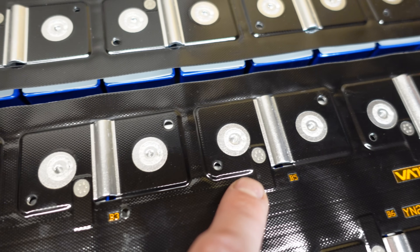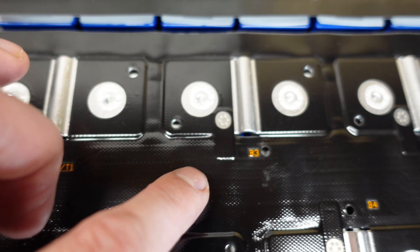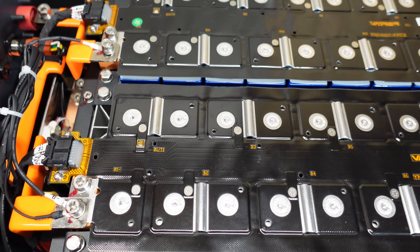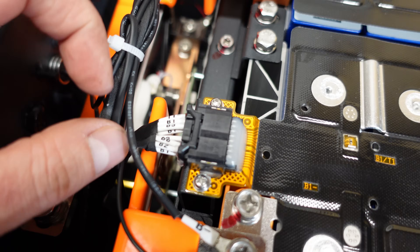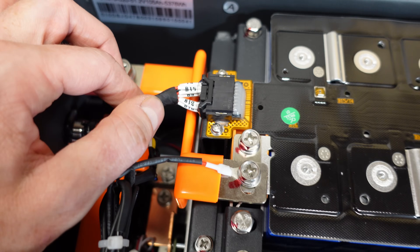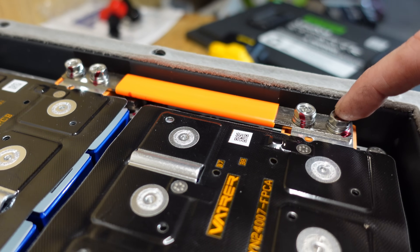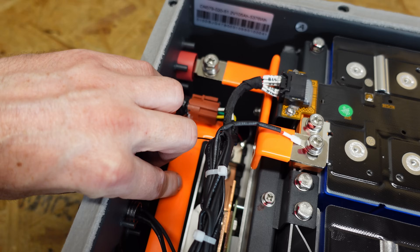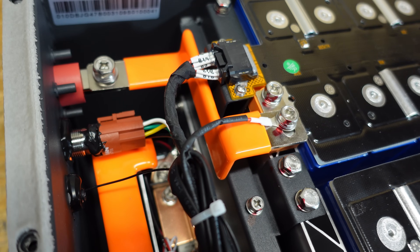They've laid a flexible mat across the top of the battery pack, and we can see each location where a balance lead has been spot welded to the bus bar. There are temperature sensors — B1/T1 and temperature sensor four — implying there are likely two more somewhere inside the battery. The mesh connects back to a connector for the balance leads, all numbered. Our interconnect between the two packs appears to be a solid piece of nickel alloy type copper. The main bus bars are solid and bent to fit the chassis — it looks so nice in here.